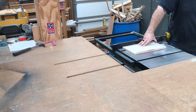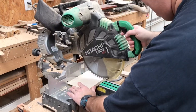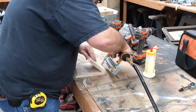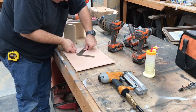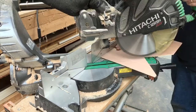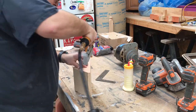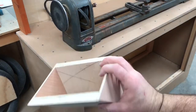Here I'm ripping a 45-degree angle on a piece of plywood, and then cutting that same plywood up into components to make a box for our switch. With a little glue and a few brads we'll attach these components together. To cut the sides for the box we're using a piece of Luan plywood, tracing and using a straight edge to get our lines. Now we're going to glue and brad those onto the box as well. Here's the completed switch box.